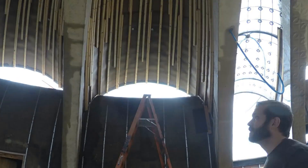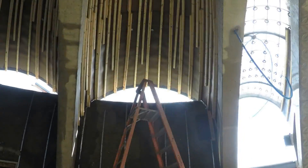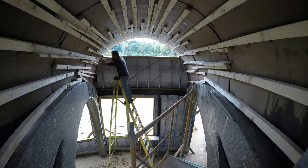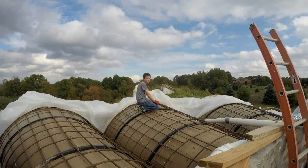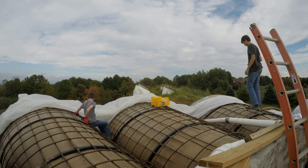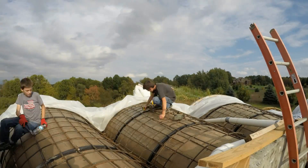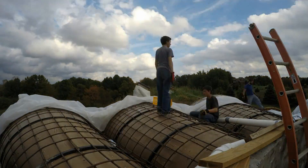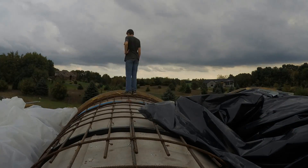You can really see the rippling because of the way the light is falling in this shot. I could have had the gunite crew out at this point, but I still hadn't even got them to agree on a date, so I figured I would use the extra time to stiffen these vaults some more. In this scene it looks like the boys are working on their own, but actually they're twisting wires that Sherry and I are pushing up from below — we're each in one vault. By this point a couple dozen of those number 14 screws had snapped, and this was before applying any gunite load, so I was concerned that the whole thing was going to fall down under load. I figured the wires could help hold even if some of the screws failed.